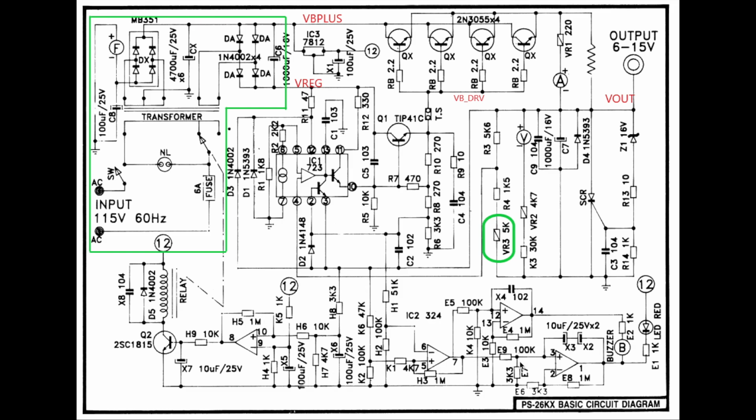Most of these, this set of 4 op amps, is an LM324 chip, a quad op amp chip. Got a high gain op amp, not very critical. So I made a few changes, and one of the changes I made was to replace this single turn potentiometer with a 10 turn to get finer resolution on the voltage. I also cleaned up the thermal conductivity on this heatsink by taking off all these transistors and applying a liberal coat of thermal grease to improve the conductivity, which was one of the problems I thought in the initial implementation, where these transistors would not be evenly heating up and causing problems. The output voltage wasn't very stable or was poorly regulated. So that fixed one of the problems, I think.